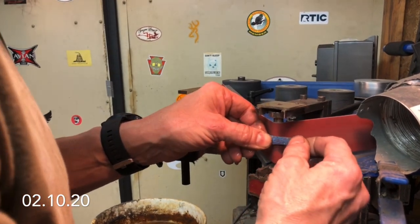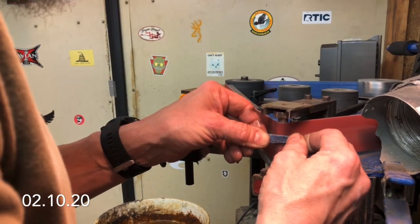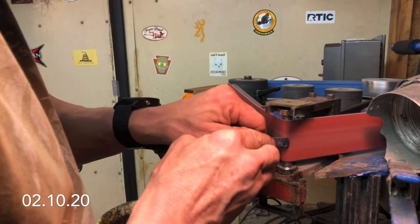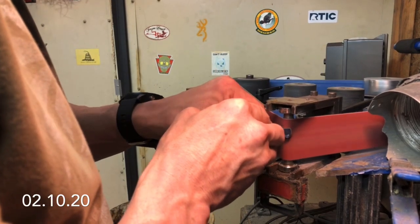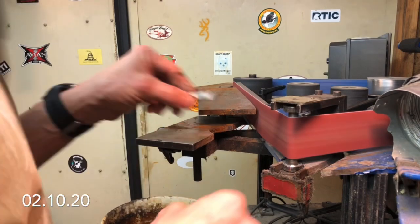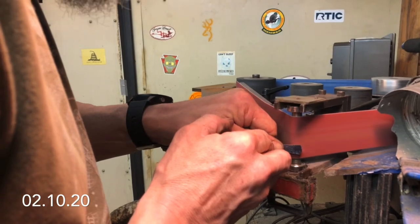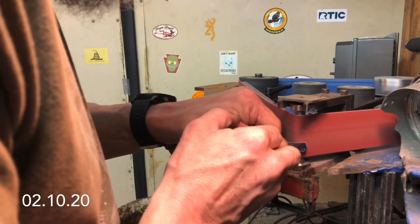Starting to get there in the middle. Now I'm coming down here — like I said, I'm not leaving meat down here on the end and trying to create the little hook, because this is going to get bent. So a little hook will actually get created by bending it instead of milling or grinding it in there. So it just needs to go out flat like the rest of it.